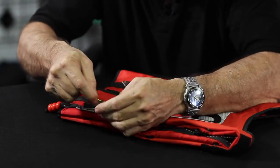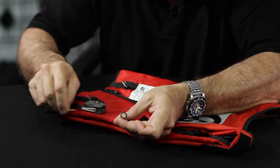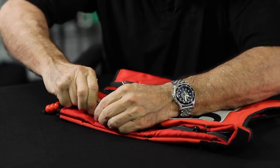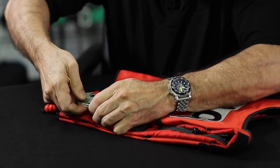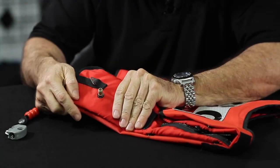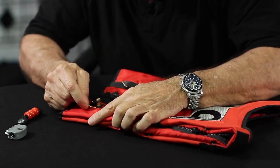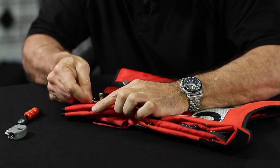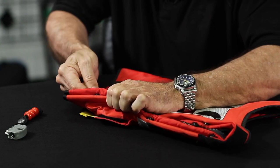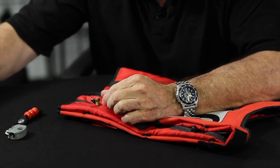And if you look at that, you may be able to see what kind of set the plastic has taken. And then we're going to get rid of that. And you just pull this thing off. And that gasket there is taking a set too. It's really squashed down to where the pressure is taking it. And so that's why you want to replace these things whenever you're doing a functional, or I say no more than 2 years you want to replace these things. So you pull that one off and you discard.